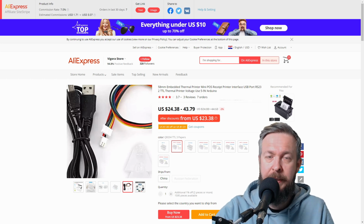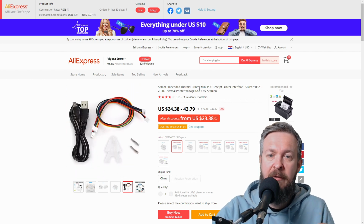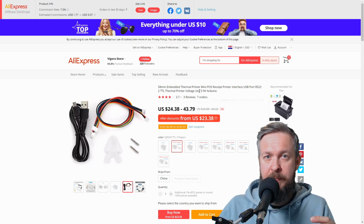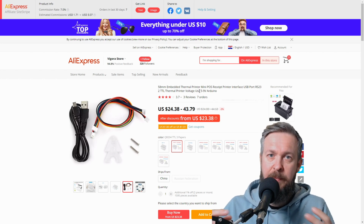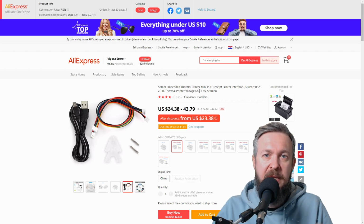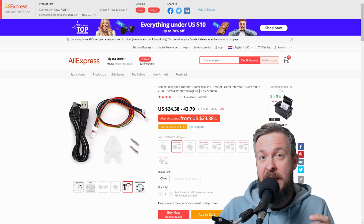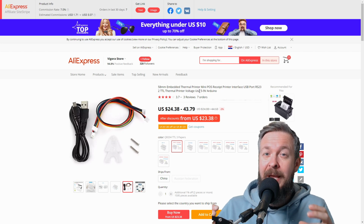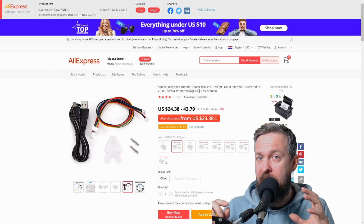A little bit of warning, this printer is using 5 to 9 volts, and printers such as these thermal printers use heaters to heat the paper to show the symbols or dots to create signs or text. If the line itself has a lot of dots, meaning that it is more black than white, a lot more power will be consumed. And it still is working.